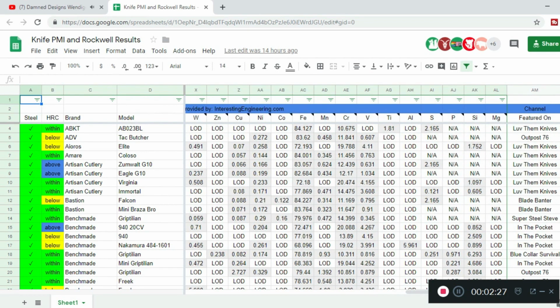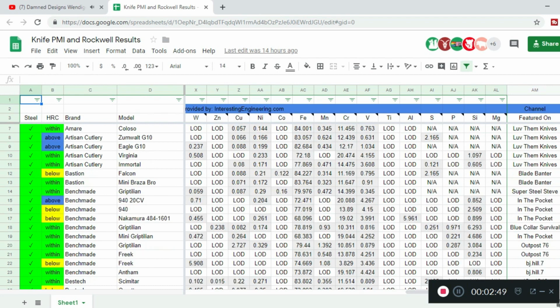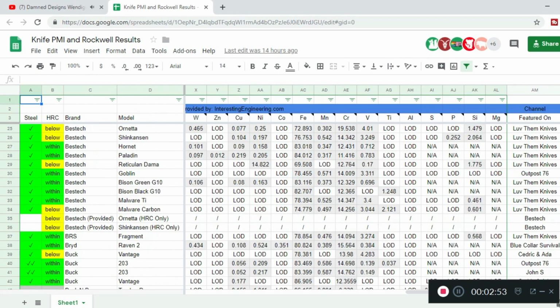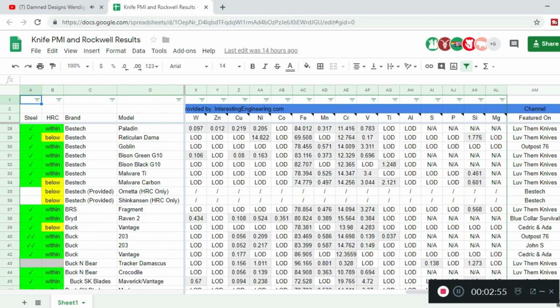There's the heat treat side, the geometry, the primary grind, and what secondary grind you have on it. Of course, there's the chemical soup, as Banter 24/7 puts it in those terms. So there's potential for a really good process and a good steel, but then there are knives that are just poorly done as far as the heat treat, which doesn't meet up to their chemical potential.